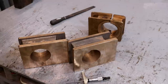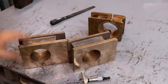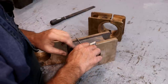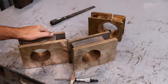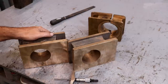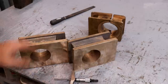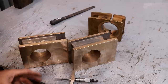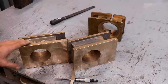However, I got over here and I realized — Bozo has come to the shop. I screwed up and made a mistake. Unfortunately, I think we're going to have to scrap these parts and start over with some new castings. I was measuring the thickness of these using a depth micrometer, and I made a stupid rookie mistake. Mistakes happen, but it's frustrating when you scrap something like a casting that had a lot of time and effort put into it before I even started. Let me show you what happened.